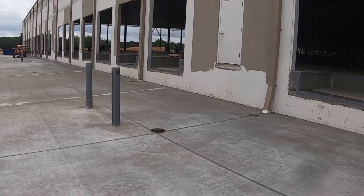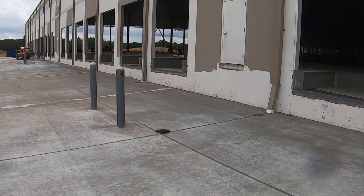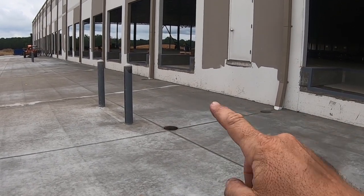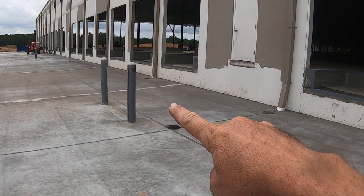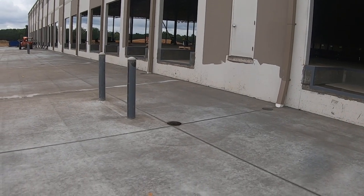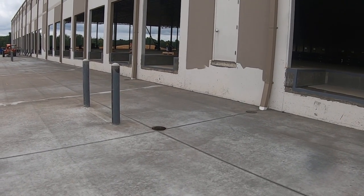What we like to do is actually measure. In the past, by myself most of the time, I would take a string, tie it to some kind of block — whether it be a cinder block or a heavy piece of wood — run it from the bottom here, pull it out, and hold it up until it was level. I'd put a line level on it and measure the difference from the string to the concrete. Generally it's around an inch and a half to two inches of drop, maybe three. We'll find out today.